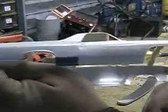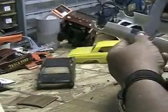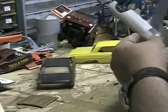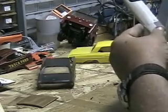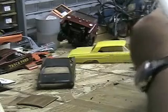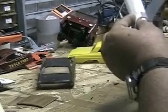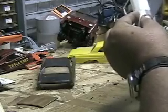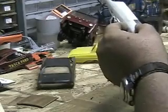There we go, there's that side. Now I'm going to go ahead and sand the back side. This will thin it up some so it'll match up with the inside panel on the other one a little bit. I don't want it as thin, but we'll thin it up some. That way, after you have it painted and you lift it up, it'll actually look pretty decent for the most part.